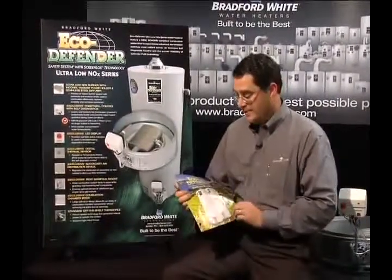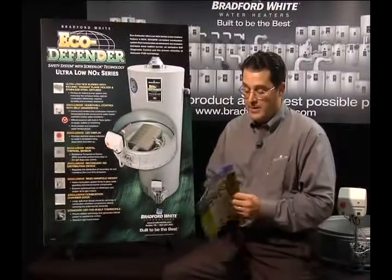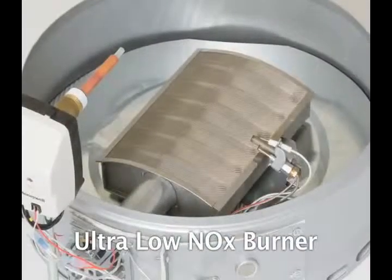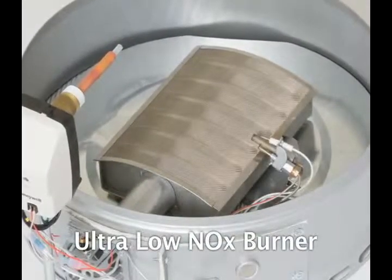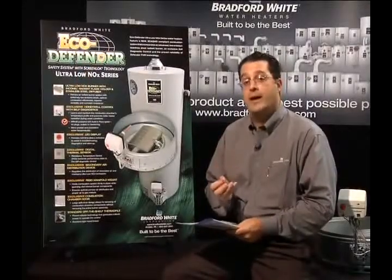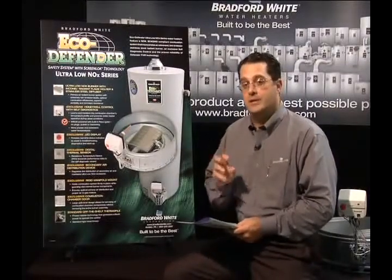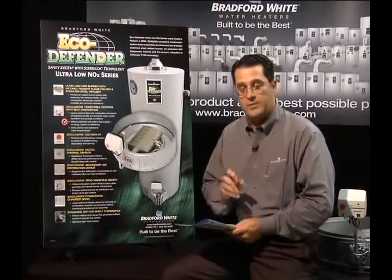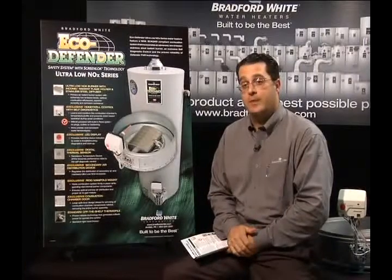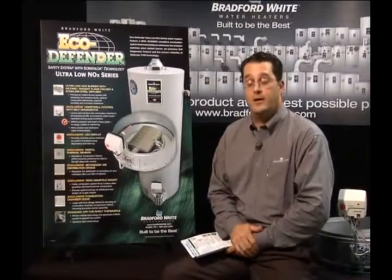We have some great tools to help explain and understand our product lines. We refer to this burner design as the Hyper Stoichiometric Primary Air Radiant Burner. It's a High Primary Air Radiant Burner design that helps reduce Nox and address the two mechanisms by which Nox is formed: high flame temperature, which we lower, and reducing secondary air required for complete combustion — that's where the High Primary Air component comes in.